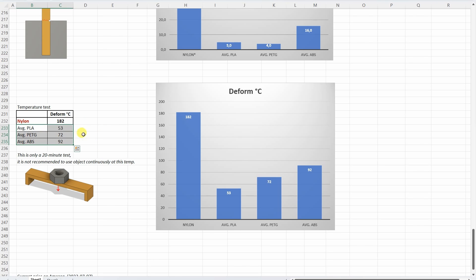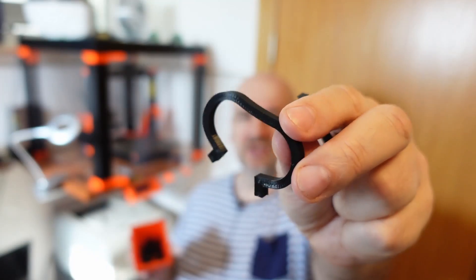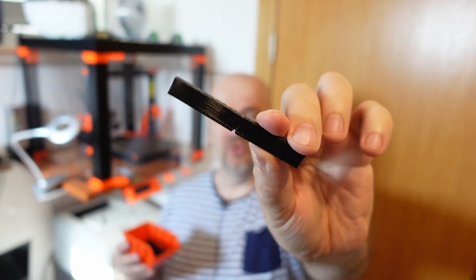These results are always comparable because they use the same testing method as earlier tests. What is very nice is that the price is not so big — maybe like average PETG or something like that. Usually nylon or polycarbonate filaments start at 50 dollars per kilogram. This nylon was a very pleasant surprise. It is a very strong material but differently strong compared to regular ABS. On one side it doesn't like constant loads because it creeps, and you shouldn't build 3D printer parts or similar load-bearing components from nylon. But it's interesting to see how it slowly gets back its original shape.